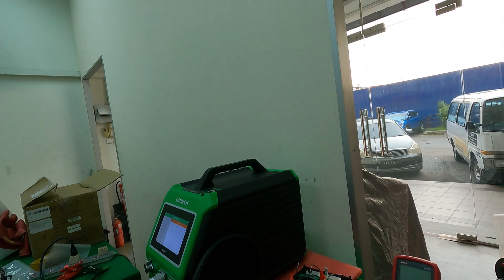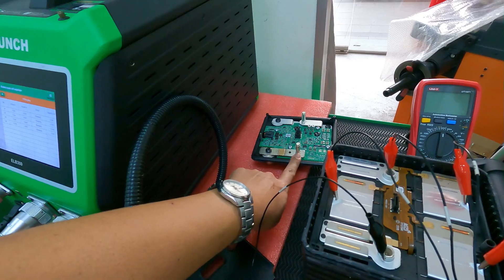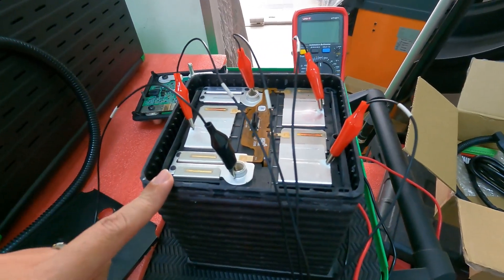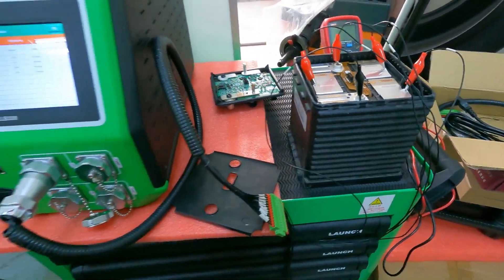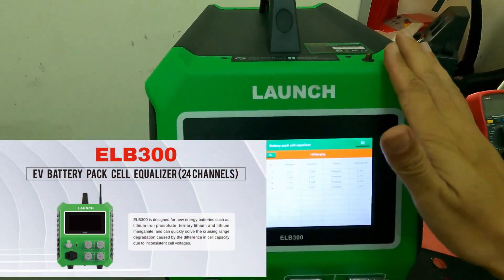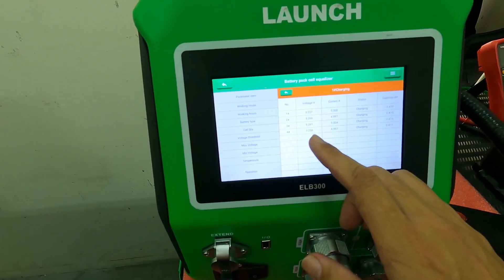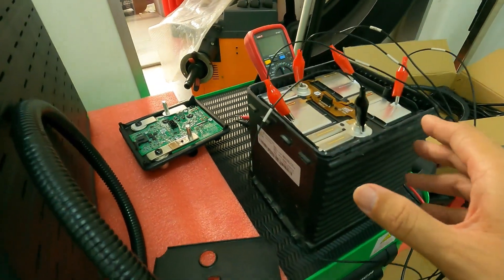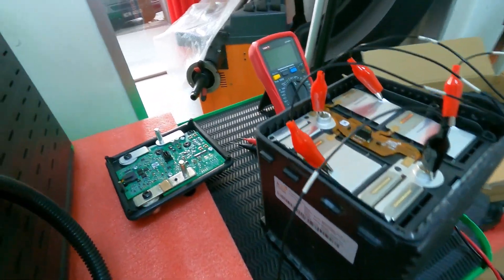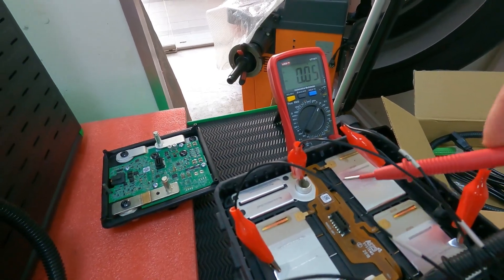Okay, so now after fixing the DCM and the battery, it needs to be charged as well. The lithium-ion battery needs to be charged with the battery cell equalizer. We will set up around 5 ampere with 3.3V target to charge the lithium-ion battery. The stack needs to be 13.2V — it's at 13, needs to be 13.2. We're testing now.